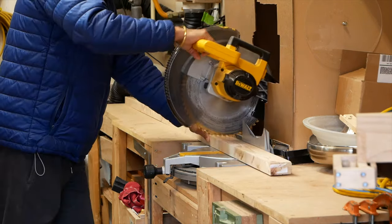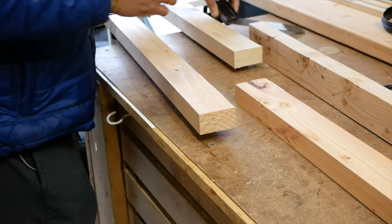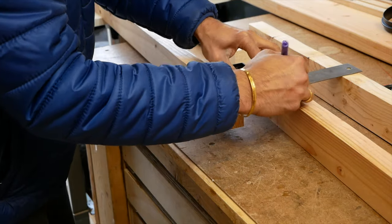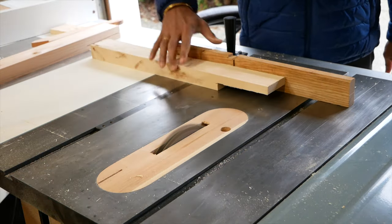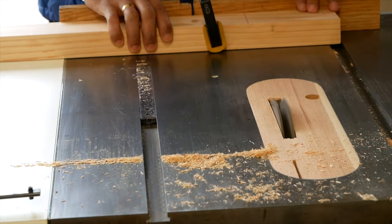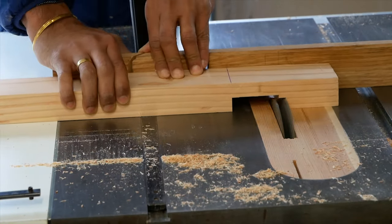We brought our boards down to rough length at the miter saw, then started planning out the half-laps. A half-lap is a type of joint where half of the material is removed from the boards so they fit together, overlapping like this, without making the joints any thicker. For our screen, we decided to overlap the boards by 6 inches, drawing out all the marks with a square and a pen. We then set up our table saw with a dado stack to make these half-laps and made a couple of test cuts on scrap pieces. If you don't have a dado stack at home, you could always do the same thing with a normal blade, making repeated cuts side by side—it would just be a lot slower.